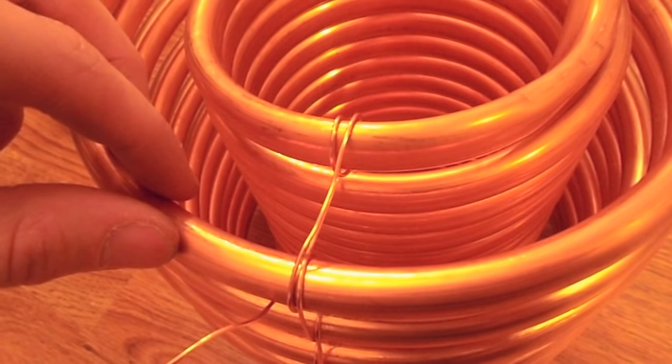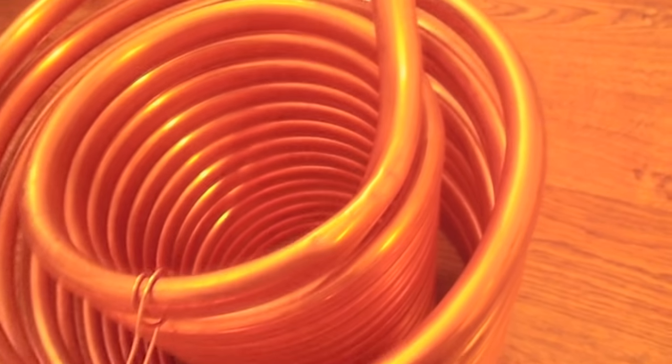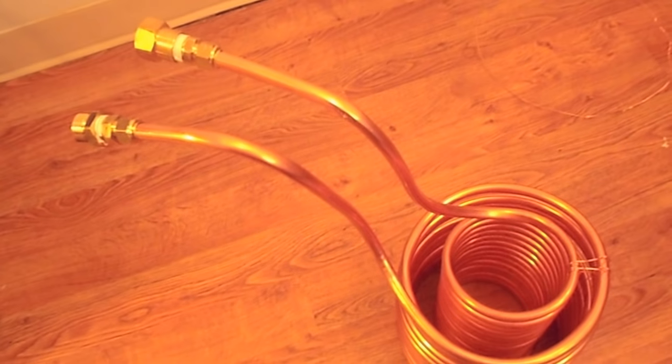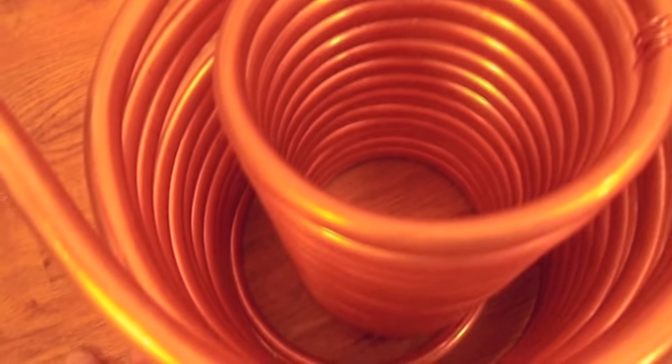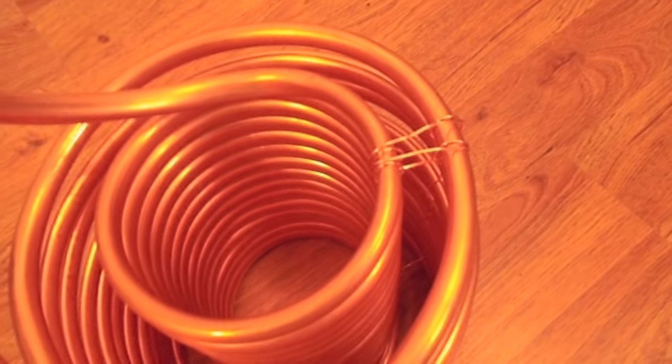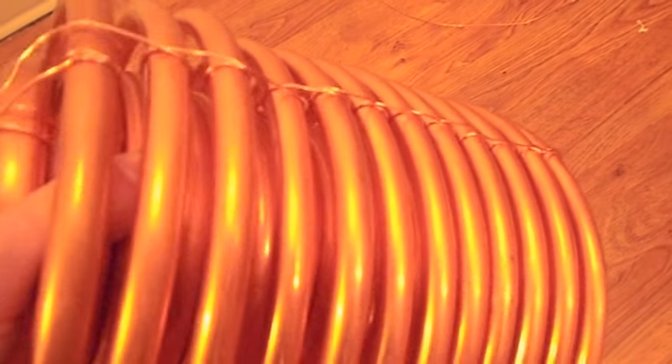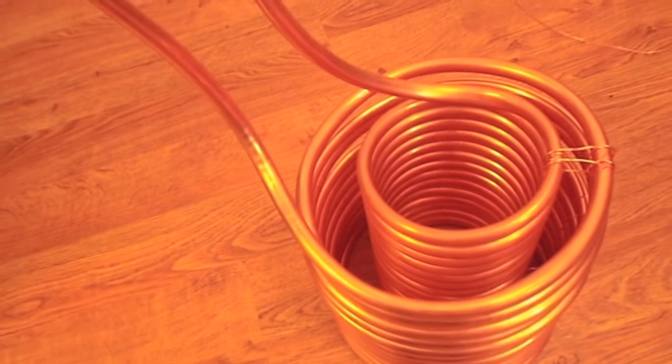As you can see, the inner coil is now pulled towards the outer coil so the spacing between the inner and outer coil is about the same all the way around the wort chiller. I'm going to wrap this wire around one more time, tie it off and snip it, and then we're good to go. Here's the final product — you've got the cold water in right here, which runs all the way down to the kink right there, which I got mostly worked out. That runs to this nicely wound inner coil, which runs all the way to the bottom of the chiller, then starts the outer coil right there, which runs all the way to the top. They're connected here to make the spacing between the inner and outer coil about even, which makes it a lot more sturdy. The outer coil runs to the hot water out right here — so you run your cold water in, go all the way through your hot wort, and put the hot water out right there, cool your wort down nice and quickly, shorten up your brew day, and make everything easier on yourself.